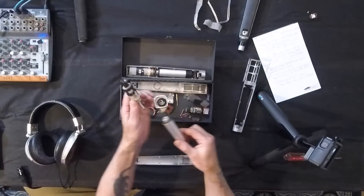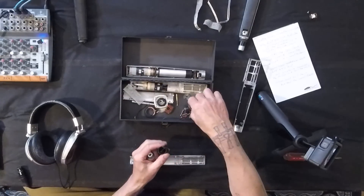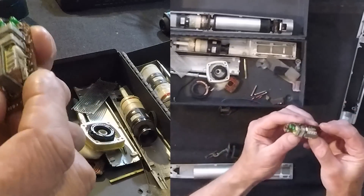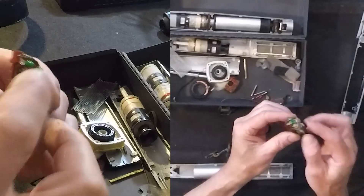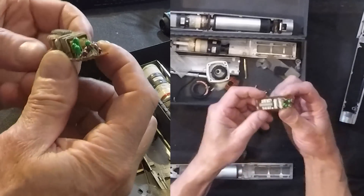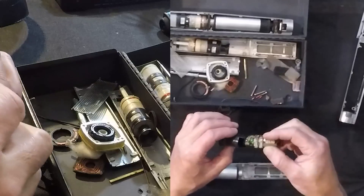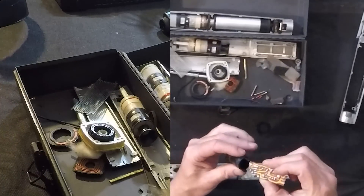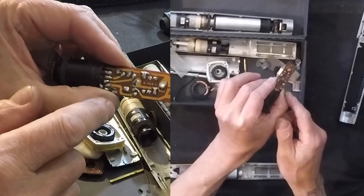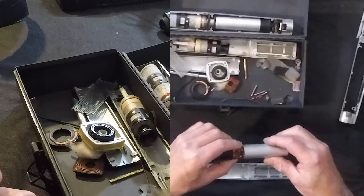Let's go ahead and look inside the chamber. This chamber actually has all of this inside of it: filters for your high boost — look at this — chokes, a transformer, capacitors, resistors. There's a full passive network, a substantial, hefty passive network built into the inside of this. It actually sits inside of here. Look at those old-school solder joints — they're huge. We would never use something that bulky now.